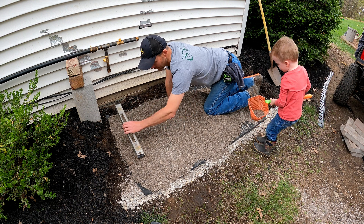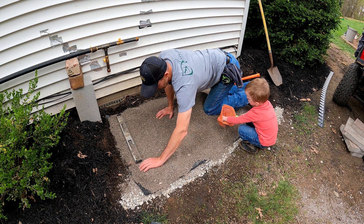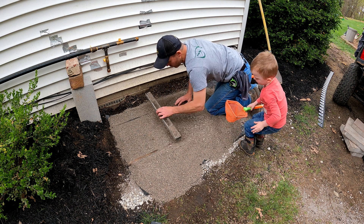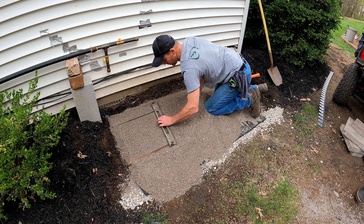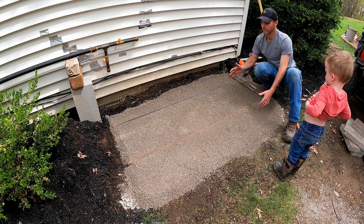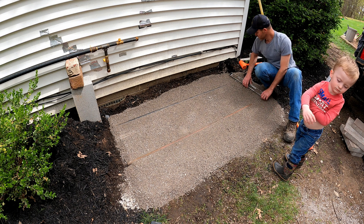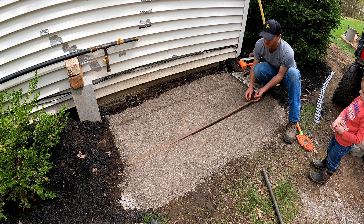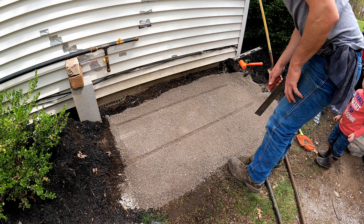Normally we'd have an actual screed tool for this, but this pad is small enough. This is also how we screed out a bed for standard pavers or retaining wall base courses. You want your bedding material to be pretty clean — this has a lot of 57-stone mixed in which makes it a bit crummy to work with. Ideally you'd have a screed board exactly as wide as the area you need. Once it's laid out, I'll pull these poles up, fill the indentations with a finished trowel, and we'll be ready to lay the geobase down.